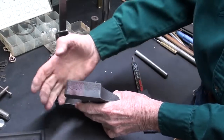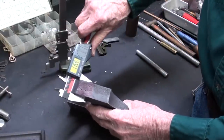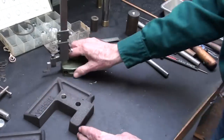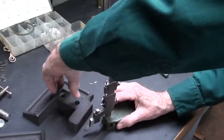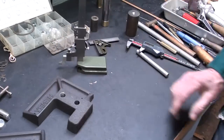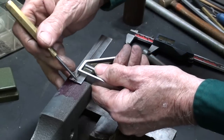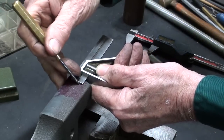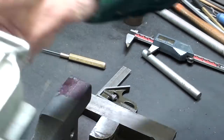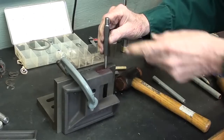The first thing I want to do is lay the hole out. The thickness right here is 1 inch and 154 thousandths. So half of that — I've already got it set for the height gauge here. Let me mark it. And with the little Lufkin square set at 5/8", I'll mark it right here. Center punch, and I'm ready to drill. I will drill at 5/16", because I intend to tap it 3/8-16.